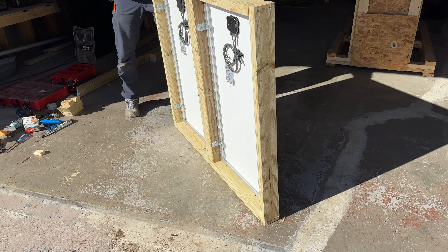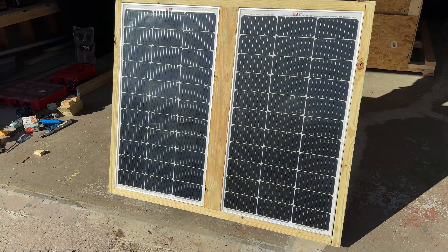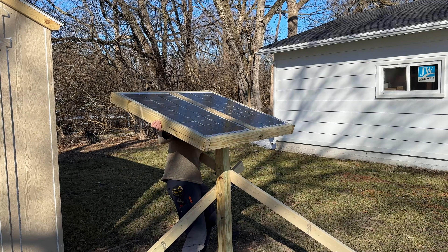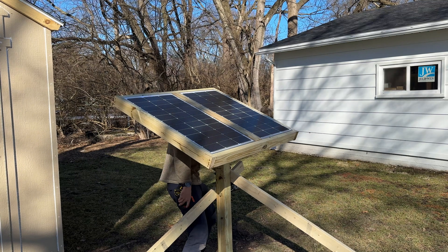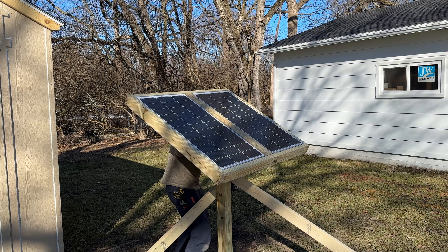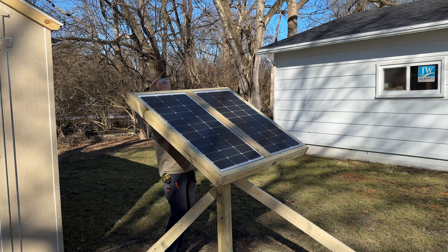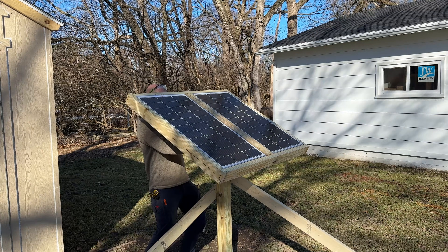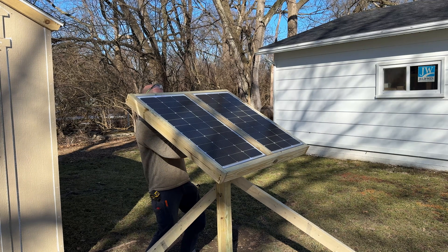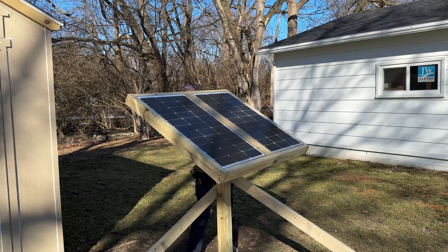Here's what you're looking at — everything's flush mounted and you have the two panels ready to go. I'll take that frame and bring it up to the post. All I need to do is line up that bolt and push it through to get things secured and mounted so I'm not fighting it. Then once that bolt is through, I'll sink additional exterior-rated screws and an additional bracket to secure that up as much as possible.